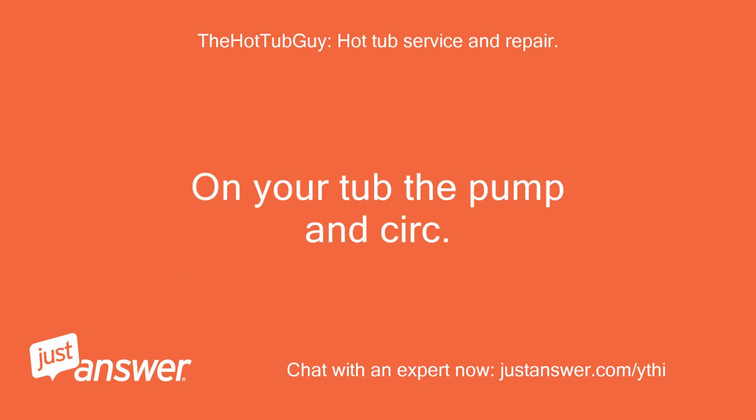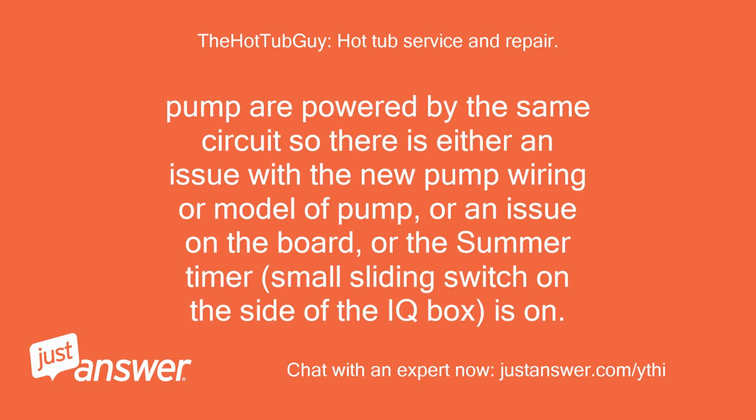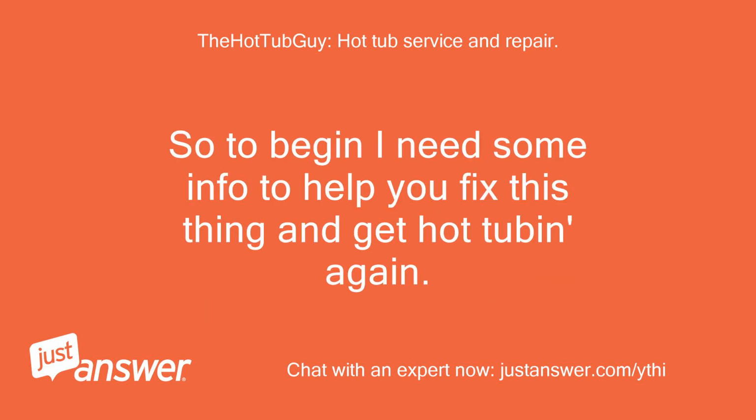On your tub, the pump and circ pump are powered by the same circuit, so there is either an issue with the new pump wiring or model of pump, or an issue on the board, or the summer timer, the small sliding switch on the side of the IQ box, is on. So to begin, I need some info to help you fix this thing and get hot tubing again.